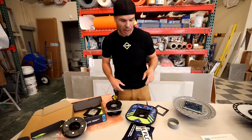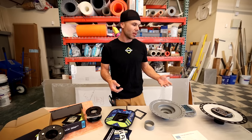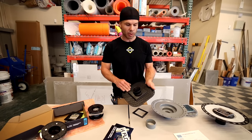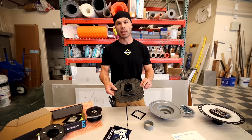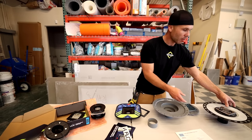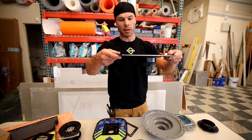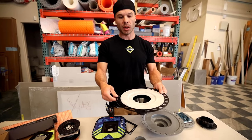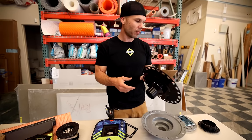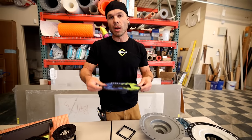There's one more feature I think was really important — especially for mostly dry-pack installations, and also for over a preformed foam pan. On the bottom of the FlowFX, they have mechanical bonding channels so that you can comb your thinset in and it's going to lock in for whatever you set it down into. Because we usually do a mud pan and then put our flange down into it. Look at the bottom of a Schluter KERDI — it's smooth plastic. Mortar is not going to bond to that very well, and it happens a lot where you pack everything down, screen it off, and the next day someone steps on it, it flexes, and it breaks the bond. When you have mechanical channels like this, the drain will lock down into your mud really well, and also into a foam pan. Laticrete doesn't have any type of mechanical bonding on the bottom either.